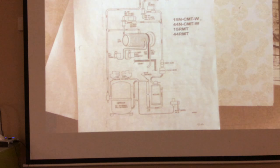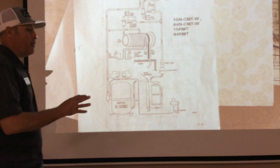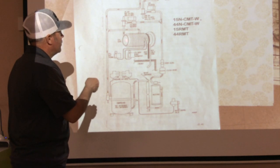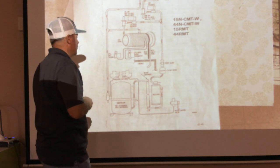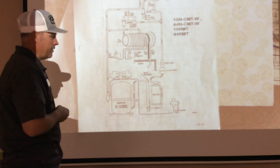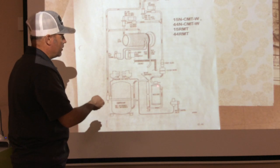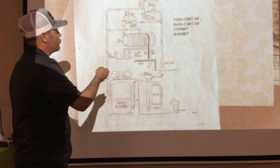I think we can see that well enough. There are some things a little different here. Here's our compressor — this will be the first time in the air conditioning department where you see parallel evaporators. You have a cylinder evaporator — the 18-degree evaporator — and you have a cabinet evaporator underneath where we keep our mix cold. Leaving the compressor as high-pressure, high-temperature superheated vapor, we de-superheat through the discharge line, come into a water-cooled condenser, reach the saturation point, start sub-cooling, sub-cool into the receiver, come out as high-pressure sub-cooled liquid, and arrive at a crossroads in the liquid line.